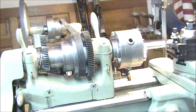The biggest thing is just clean it. Make sure everything is nice and clean. Wire brush the living crap out of it. File it. Do not use a die grinder. Do not use any sort of grinder. Also, after you're done heating it up, which was my mistake, which I didn't do, is wire brush the joint again,